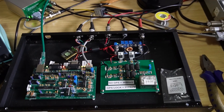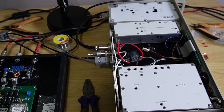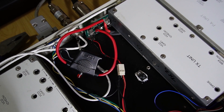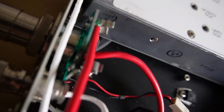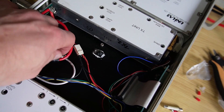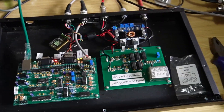The issue with this one — I didn't know what the problem was, the repeater just was not transmitting. I went up to the repeater site, saw that it said it was transmitting, but it wasn't. I rebooted it a couple of times, checked voltages, couldn't find the issue. Dragged it all the way back here, and guess what? It worked — Murphy's law, right? I actually found out the reason: these repeaters use a fuse holder in here, and the fuse that I had had gone high resistance. So when it was drawing current and getting hot, there would be a high resistance joint, current wouldn't be able to flow, the voltage would sag, and it would stop transmitting. If you look on the back, you can see the track is actually burnt out and the board's all black at the back of the PCB. So what I ended up doing was I put an automotive fuse in here and soldered it directly to the front of the PCB, which is undamaged. It works. I've had this on test for the last week and a bit and it's actually transmitting now.